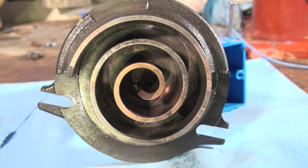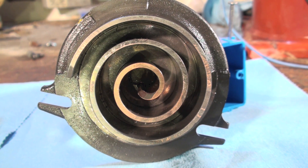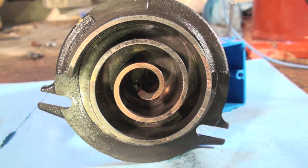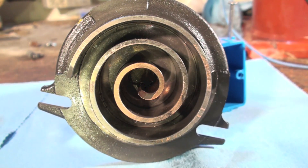That's copper plated, and of course that has raised the surface up a little bit. The clearance is extremely tight on these things — the scrolls must be the same height and must have a specific clearance so they ride properly, otherwise they won't seal. They make a very accurate seal between this scroll and the other scroll's bottom portion, and the same thing with this one's bottom portion.